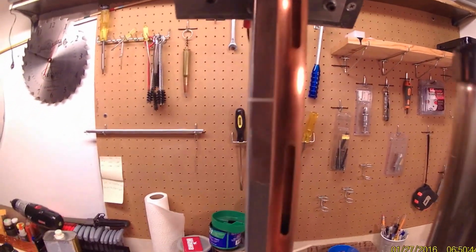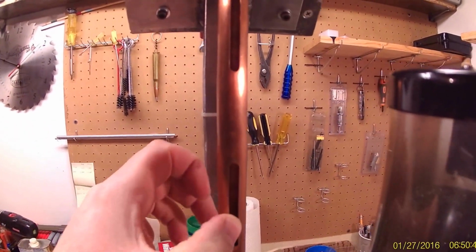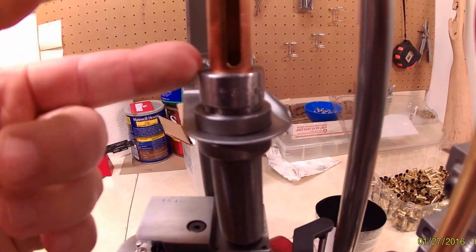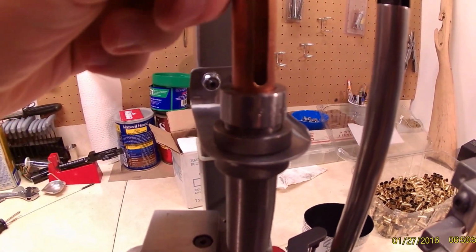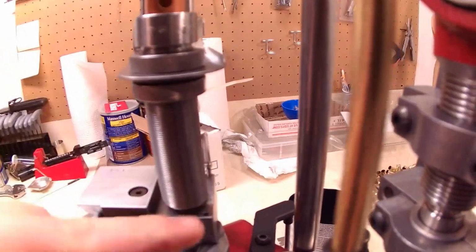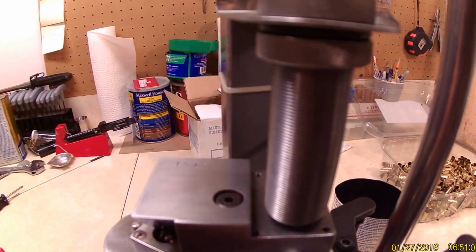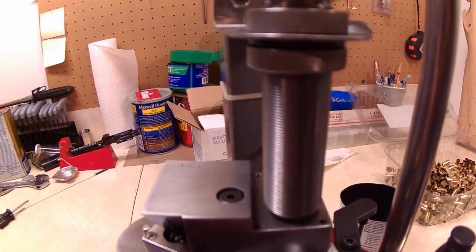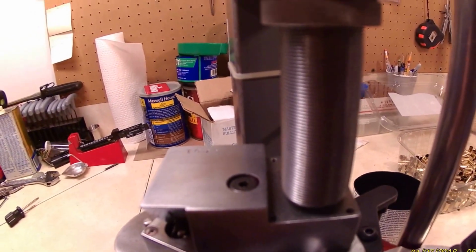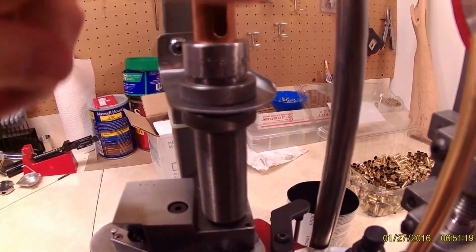The feed tube itself, just a piece of 1/2 inch copper, milled windows in it so you can see where you're at. The block, straight through, is your OD of your pipe, except for at the very bottom it tapers into a cone shape nub. I think I did it at 550 thousandths, give or take a little bit. This allows most of the cases that I do. You could change it for whatever you like though. When you get to new cases, you just loosen it, move it up and down for the height of the case.